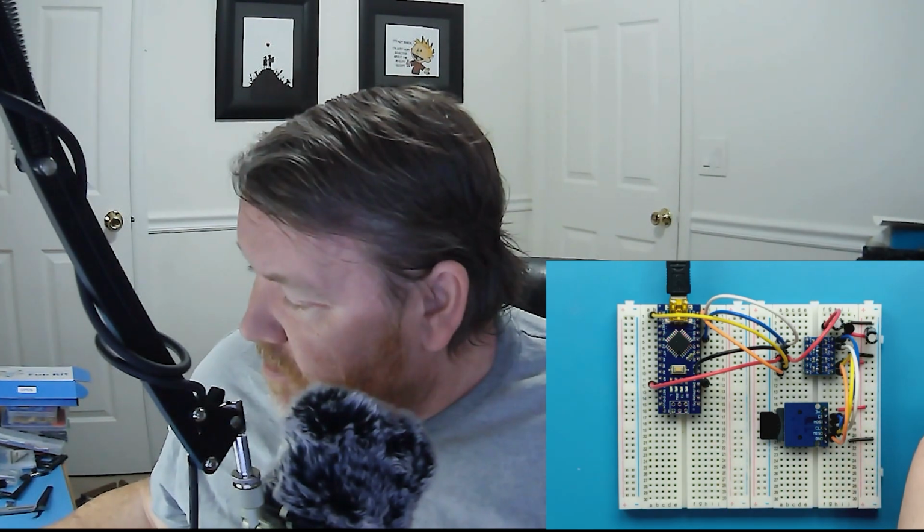So it's a very simple circuit really, but the little gotcha is to make sure you put the level converter in there, because you really don't want to keep blowing up or burning out the SD cards, because they really are limited to 3.6 volts absolute maximum.